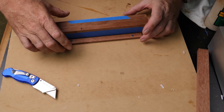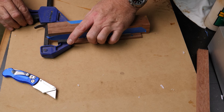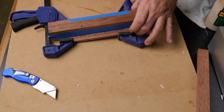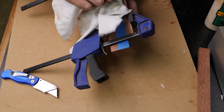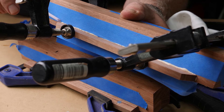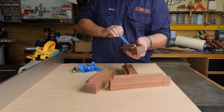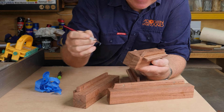When I attached these frames to the inner sides of the uprights, I realized that blue tape was also going to be my major friend on this project. It made it a lot easier to clean up the glue squeeze out, as well as using these plastic straws that I picked up last time I was in Japan. You can't get plastic straws in Australia anymore, so I keep a stack on hand just for this reason. Once everything was dry, it still needed a little bit of a clean up, but nothing like it would have needed if I hadn't used the tape.